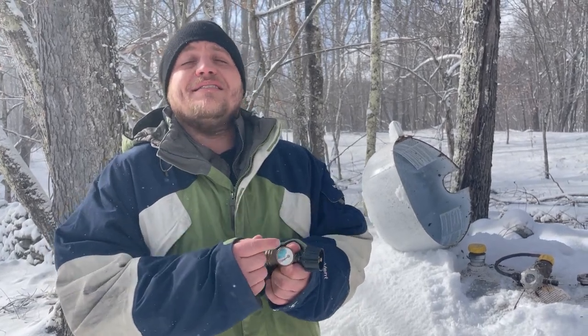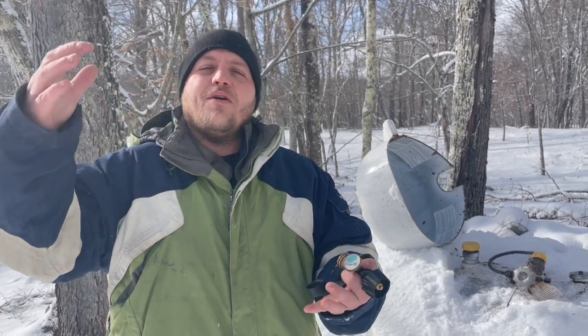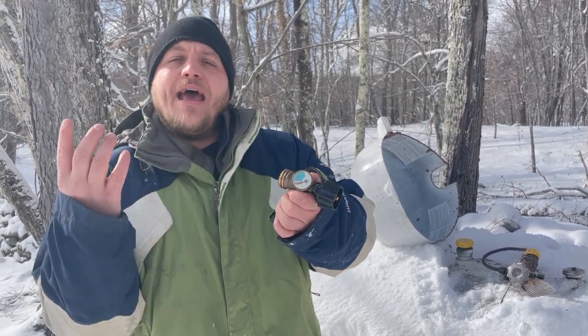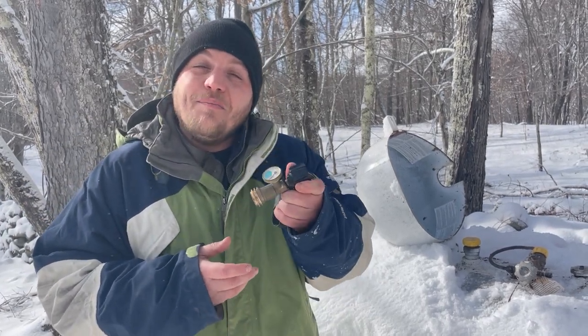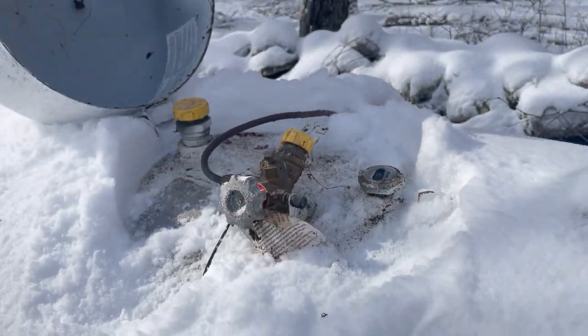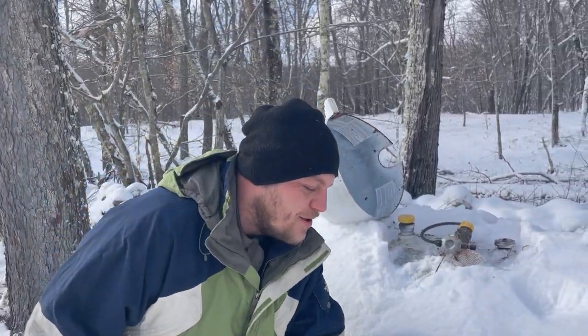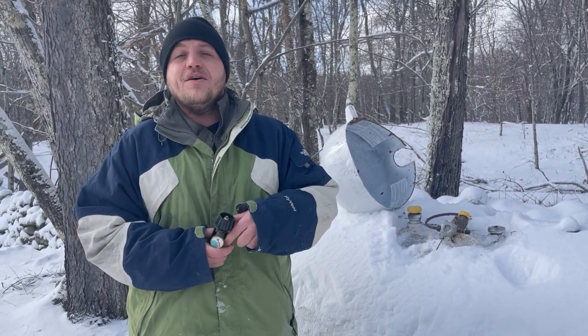I want you to be able to know the exact amount of propane in your tank, but these cheap gauges are no good. They're pressure gauges, and we already talked about how tank pressure tries to stay at the same point whether there's 20% or 80% liquid propane — that's how the tank works. So these are never accurate and they move more with air temperature than with the actual fill level. Some people get confused because the gauges on home tanks are accurate, but those are mechanical with an actual float inside — a completely different setup.